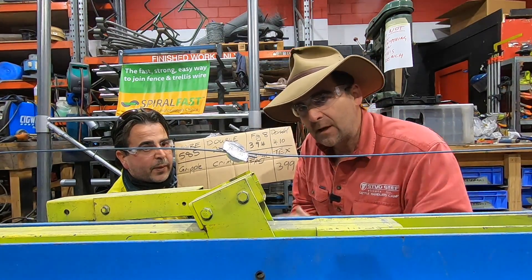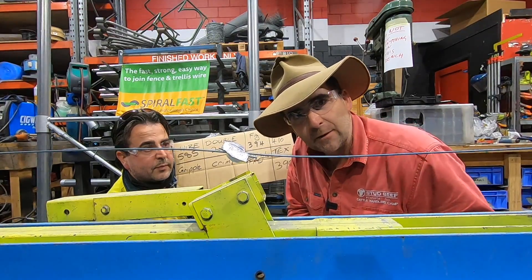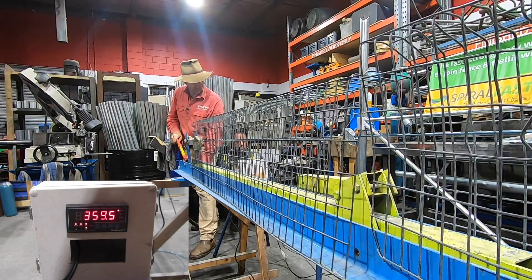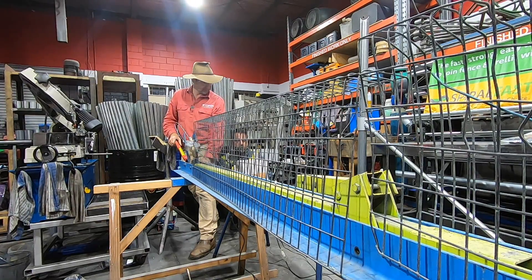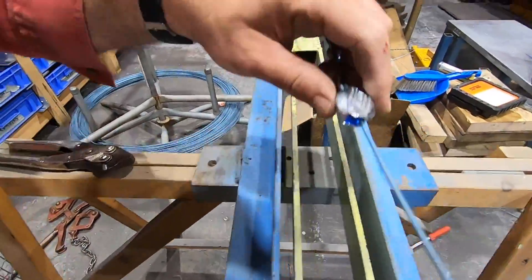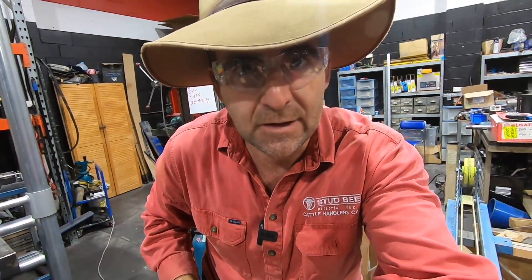So now let's check out the Gripple — it's mounted on our test platform and I'm really keen to see how this one works. There's a bit of wire poking through each side. Gripple in the test bed — no loss of length as you would expect. Solid joiner. That's given way at about the same tension as our knots, about 370 to 397 kilos. Here's something interesting: it's given way and slid all the way down the wire to the Spiral Fast securing the end. So it's not only given way, it's run down the wire as well. We'll do a replay and slow-mo in the video.